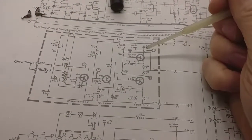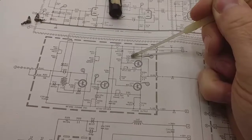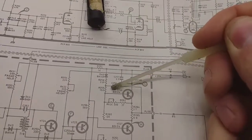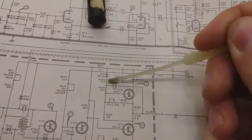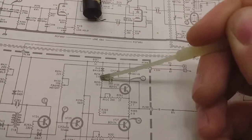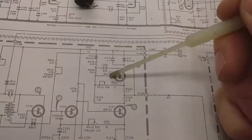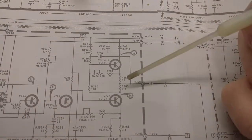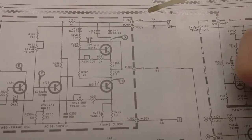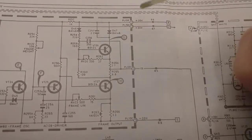So here we can see C256 — the 250 microfarad electrolytic that was burst open. And here's R258, which is 220 ohms, which was burned open circuit. So he went short and he went open. That would probably account for our power fault, as the transistor here wouldn't be getting switched. So we'll bang the panel back in and we'll see what it does now.